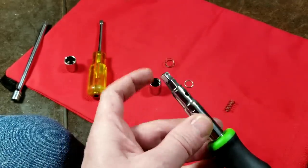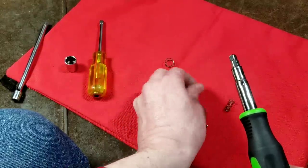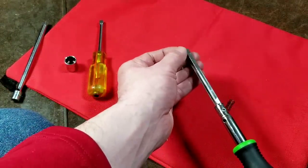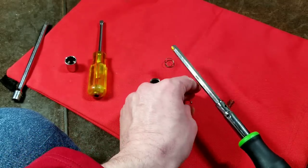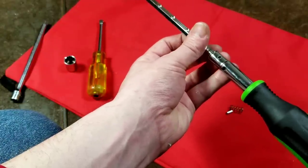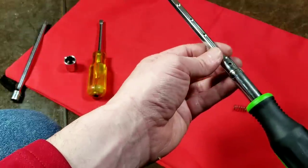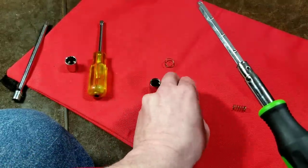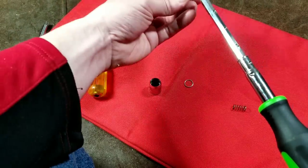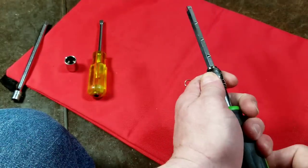So there's a little modification — you just pull out the spring. To reassemble it, it's actually pretty straightforward: you put one ball there, then make sure you have it in the right way. There's a certain way to assemble this. You've got to rotate this so you can have both balls sitting in there. Get that hole lined up so we can have the little ball there, the large one up top, then the spring. As soon as we get this collar on here, everything's held together.